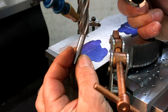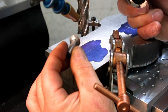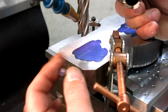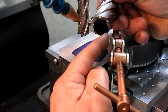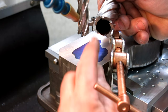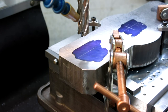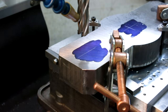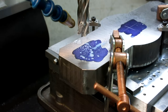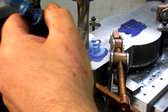So, you know, with a normal drill bit, all that would get converted into chips, right? So you get, they call it the power saver slug or something like that. I don't remember what they call it, but it saves energy because you have a cutting speed here, whereas a drill bit at the center, the cutting speed is actually zero. So these are more efficient. And these produce very accurate holes, and not that we need that in this case, but it's a quick way to get holes. We'll go ahead and pop one here. Make sure I'm in the right spot. And here we go.